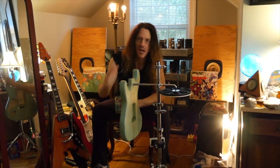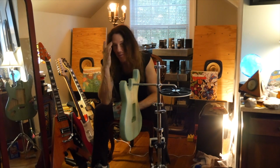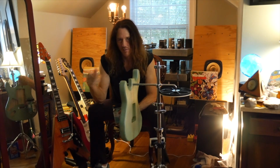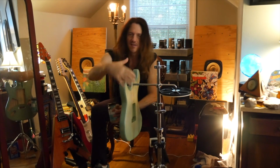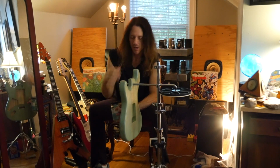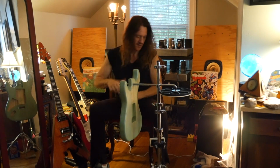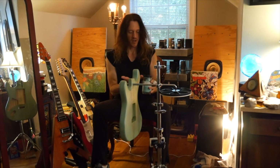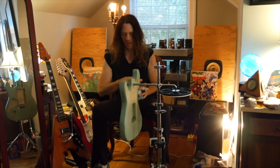So you could put a really light one on and then do it one more time. It's always better to do multiple thin coats than just a few heavy ones with this type of thing. Even though this is self-leveling, you don't want to glop it on. You want to go slowly. Just build it up. Okay, so let's see what happens. I'll try to just do a little, see how far it's going to go. Might get to a fourth coat. If not, we'll dump it all into the jar and be done today.